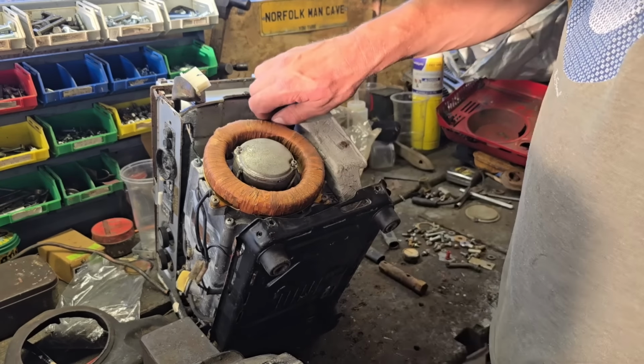Okay, let's screw this back together. My screwdriver went on the floor. Let's tighten these ones back down. Because I don't know why someone's took this to pieces. Haven't got a clue. But I think what we will do is pop the points cover off and just give the points a clean up, because these are old enough, probably 60s, to have points in them.